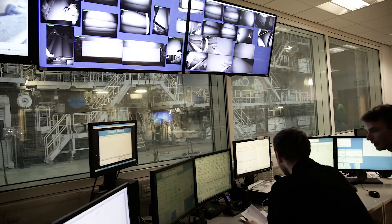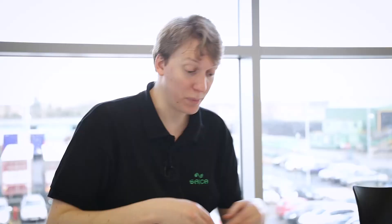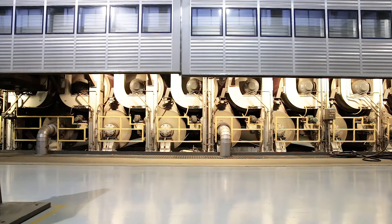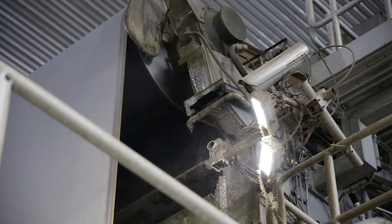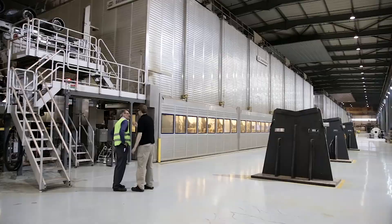A lot more slimline. The technology that Prosomex uses, where you've got the HD cameras snapping — like a snapshot of the paper as it moves down — as opposed to a line scan camera that will continually take an image. The old system would sometimes lock up because there was just such a huge amount of data coming from the cameras. These were all things we were thinking of, not just in terms of technically getting the image we wanted, but also how simple it was to handle and maintain. And that's why we chose Prosomex.